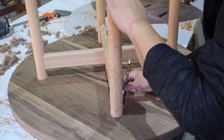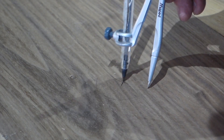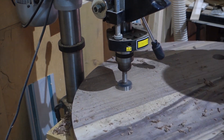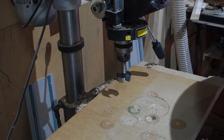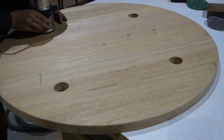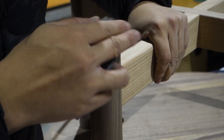I'm marking the location of the legs and drilling holes in the tabletop. The top part of the leg will go through the tabletop, so the tabletop is actually sitting on the stretcher. I'm using a 45-degree router bit to chamfer the edge — I'm not using a round-over bit as it's already a round tabletop. I think the 45-degree bit gives a slightly sharper look so everything is not too round.